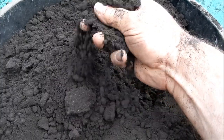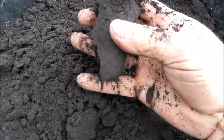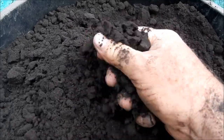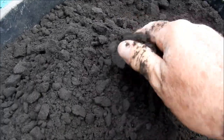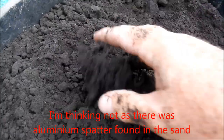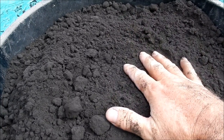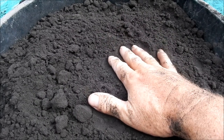We've got this binned up. This sand is just beautifully conditioned — it's really lightweight and fluffy, yet holds its shape very well and has some really good green strength in it. That's how you want your green sand to be if you're doing any sort of casting. The big unknown is whether I've got coal dust in it — I guess we'll find out. I'm just going to lay a light sprinkle of water on top, put a plastic bin liner over the top, then put the lid on — that'll last for quite a long time, at least until we're ready to start ramming up our moulds. See you soon.